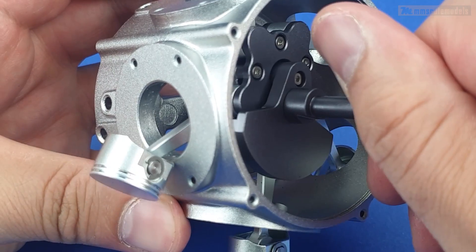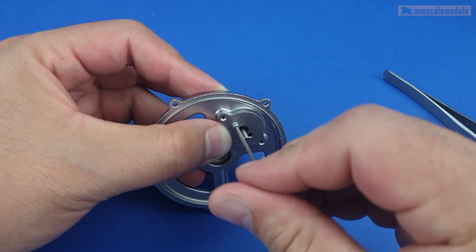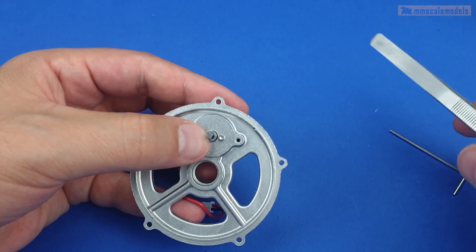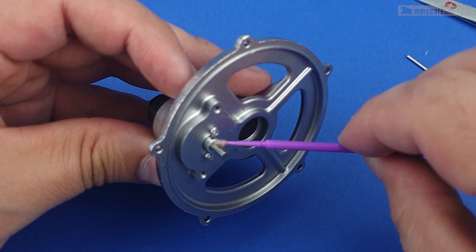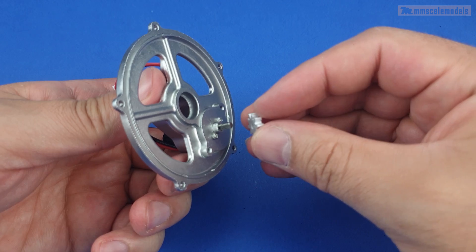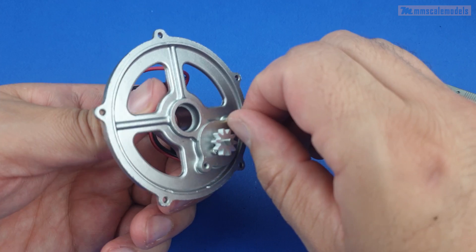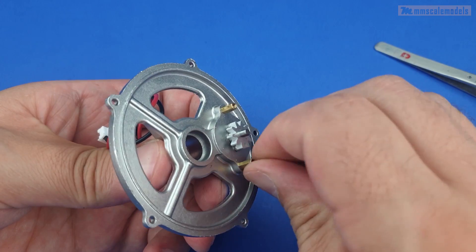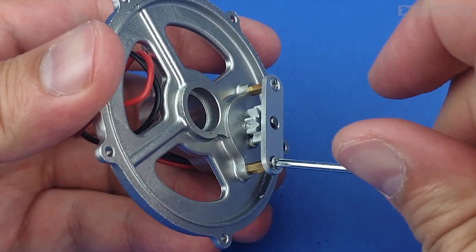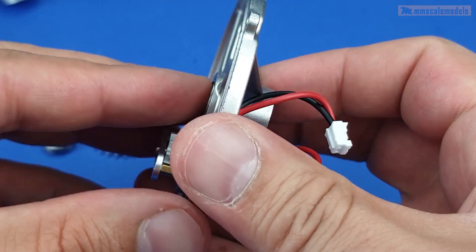And there we have it — great. Next up we will assemble the crankcase rear cover. Here we'll need to attach the electric motor; I'm going to screw it in now. Let's put this gear sleeve right here, then let's put some grease, some lubrication on that. Next up is a gear — here again we have a notch to secure the position of the gear — and then we have these copper studs that we'll leave right here. One more, and then we have this plate, which will need two small screws. Now on each side you'll need to have one bearing for the shaft.